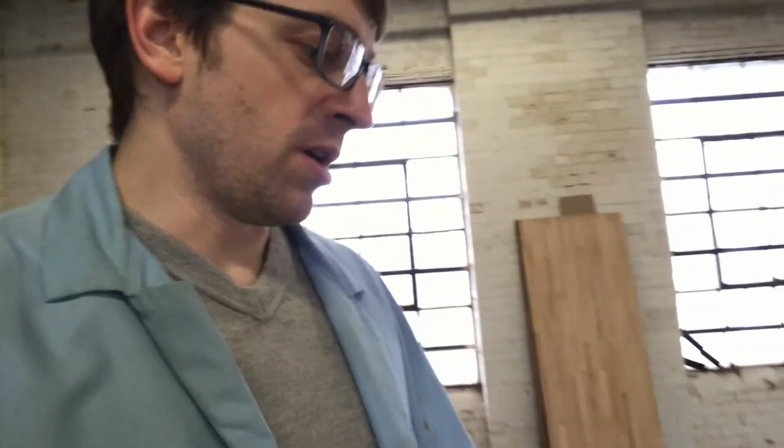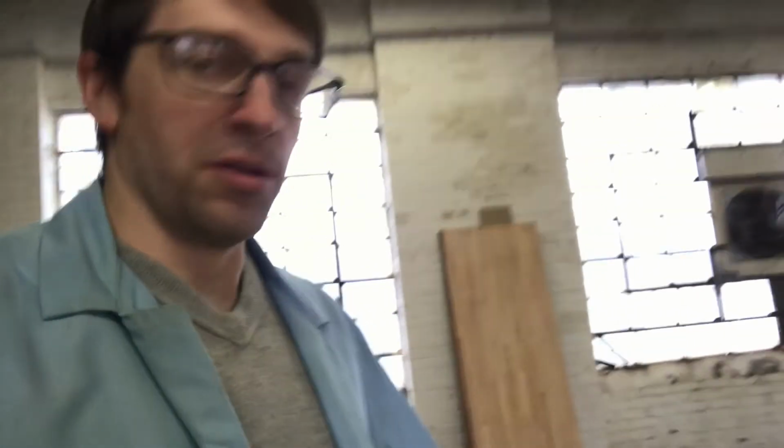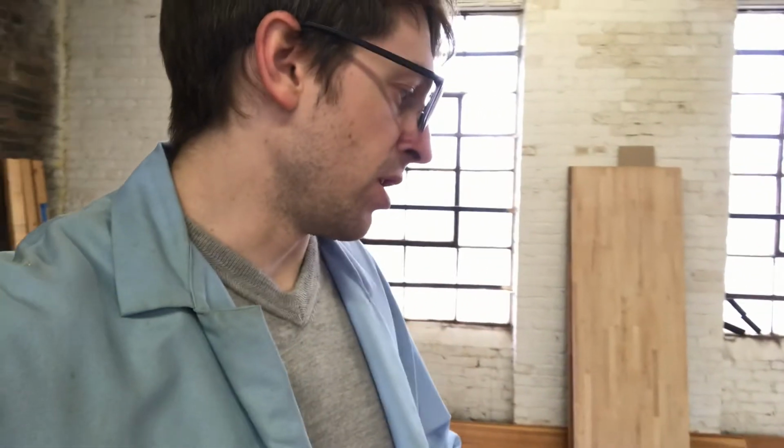But the three key things are, we're not using a brush. We're not putting on a big wet coat. We are wiping off the excess, and a little goes a long way. So put a little dab on, wet it out, let it sit, wipe off the excess. That's the Universal Tung Oil Sealer. Works great on countertops, floors. We have some videos coming up later for that.